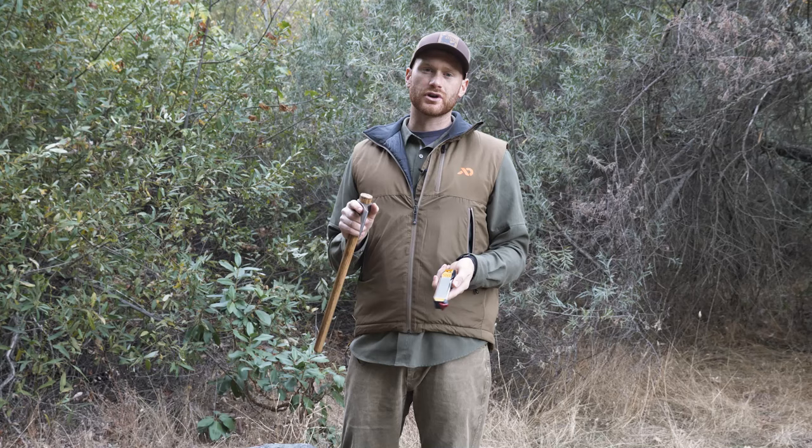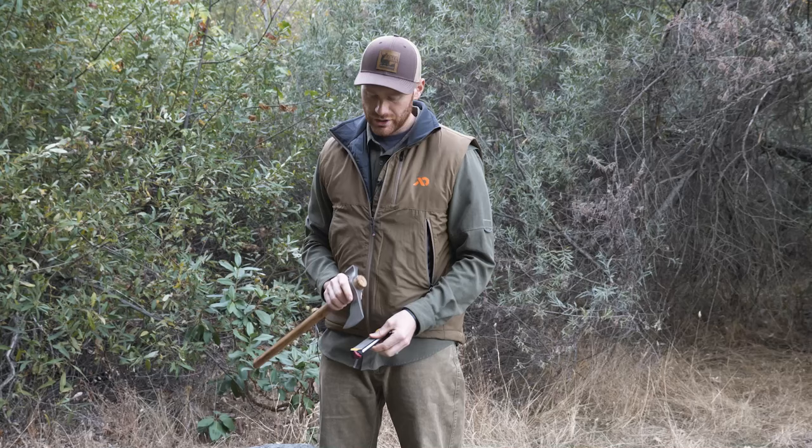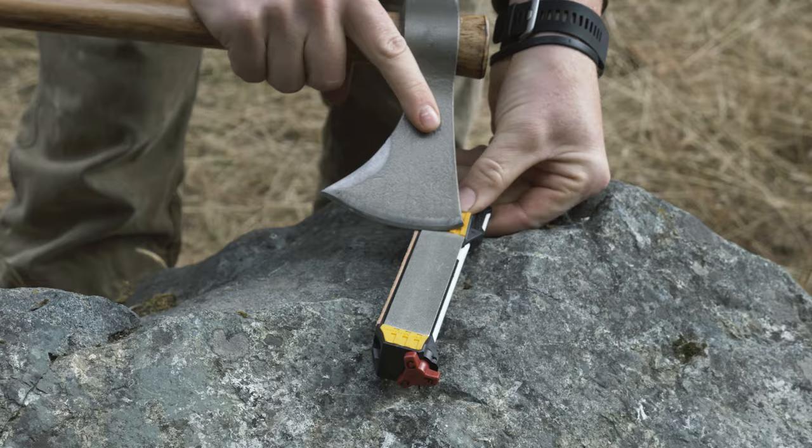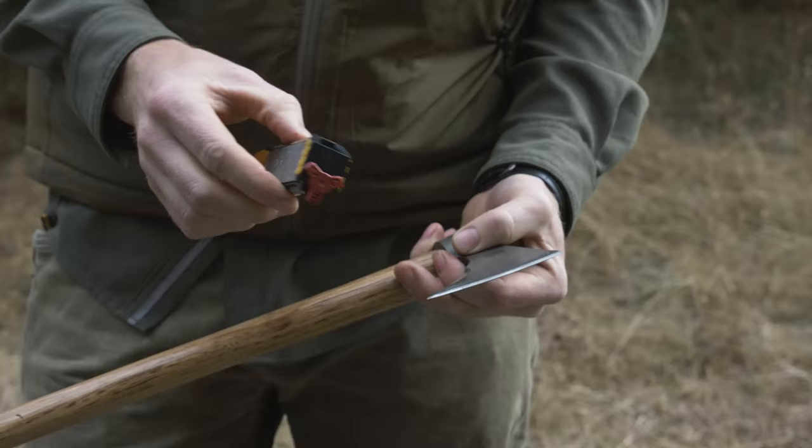The field sharpener is also great for sharpening larger tools like hatchets and axes. For some tools you can bring the blade to the sharpener and work back and forth almost like you would a knife. I like to use the coarse 220 grit — it removes material quickly and helps you restore the edge. You can also set the field sharpener down on a rock, work surface, or tailgate for good leverage and to keep your hands clear. Or you can bring the sharpener to the axe, hold it in your hand, keep your fingers behind the plane of the abrasive, and work back and forth like a file.